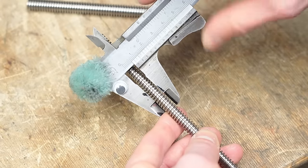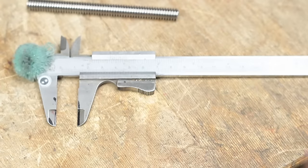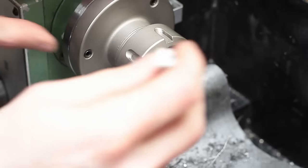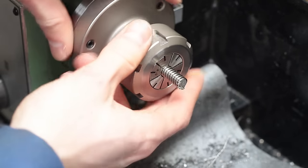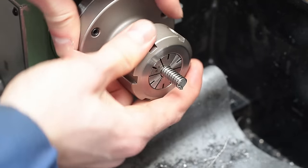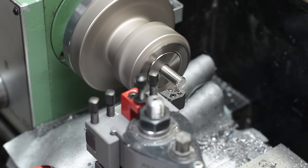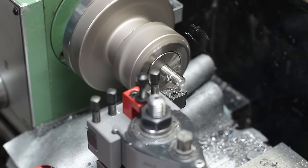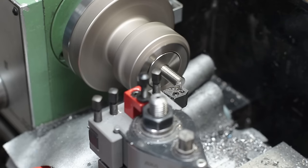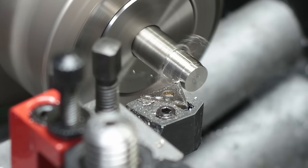But what sounds like a bug first turned into a feature during the build process. The new spindle is actually made out of two parts: one is the standard Acme thread spindle, and the other is the custom machined end for the bearings and handwheel. It's the same process I used on the cross slide spindle, as I prefer standard parts over cutting an Acme thread spindle by myself.